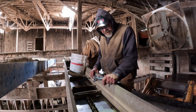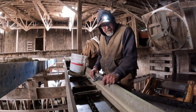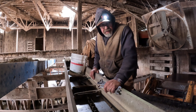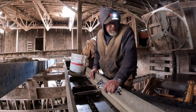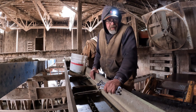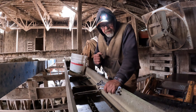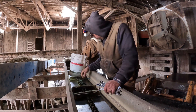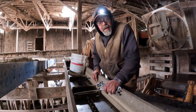So we're going to do that this time. The other week we replaced the wrap-around on the boot down there — it was worn out — and we totally tore it apart. The conveyor has been making a lot of noise and actually shaking a little bit, and I think it's largely due to the chain. You can see this chain — there's pieces of it falling off, it's all rusted apart. So that's the job.